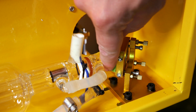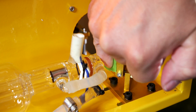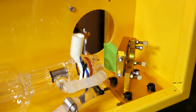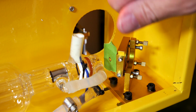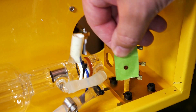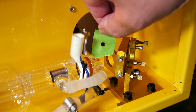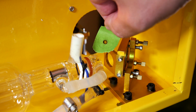You do this by taking a piece of masking tape and simply placing it over this little circle here where the laser beam enters the mirror. Once you've got the masking tape on, just go ahead and hit the test fire button on your laser. You can now see how the laser beam is actually entering the mirror. The laser beam is centered in the middle of the ring, so there are no adjustments needed at this particular point.